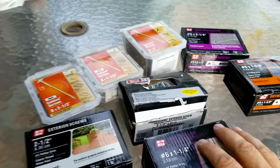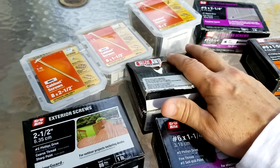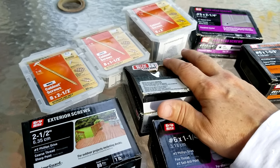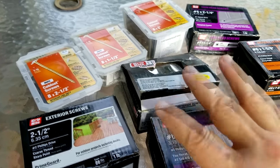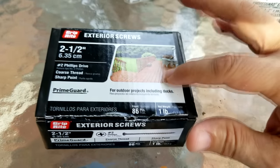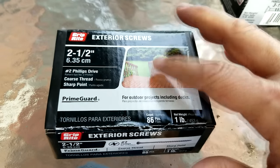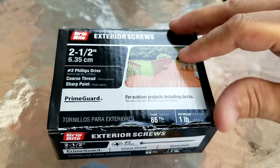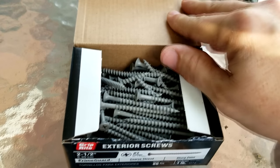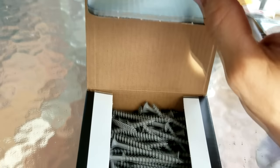The tile guys did such a perfect job — it's absolutely perfectly level with a six-foot level. These were old-school guys who did great work with the mortar and mud underneath, like they would do marble. So we know with confidence we can put our cabinets together on a perfectly level floor and they'll be nice and perfect as we tie them together. Before we install the cabinets, I wanted to have a little chat about some of the fasteners available for installing cabinets.